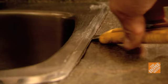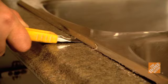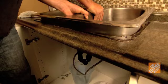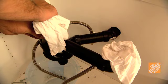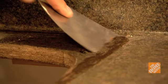Only remove your faucet if it's attached to the sink or will be attached to your new sink. Use a utility knife to slice through the caulking around the rim of the sink — the sink should now lift easily from the countertop. Place an old cloth in the top of the drains to prevent debris falling in or water backflow spilling in the cabinet. Check for water damage to the countertop and clean any excess caulking from the rim using a putty knife.